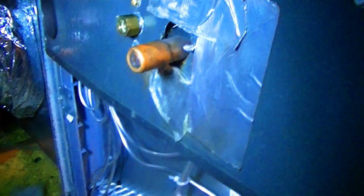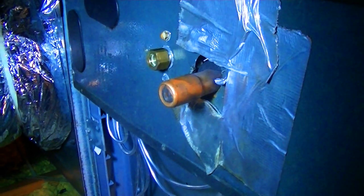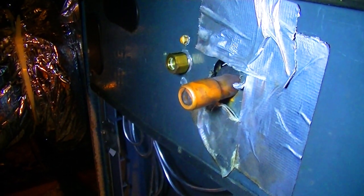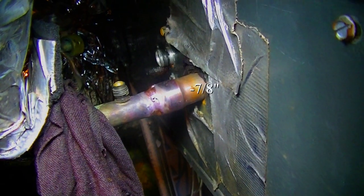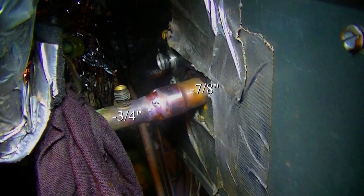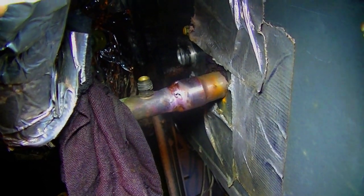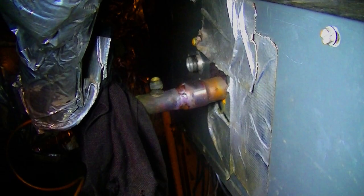On the back here, there is a Schrader port on that particular coil. If you are new to brazing or don't have a lot of experience brazing, go ahead and take that Schrader core out. As the years go by you'll have no problem brazing it up with the Schrader core in there. I do wrap a few rags on the inside so it should be well protected, but if you're new to it and feel like you might be dwelling on a single joint for a while, go ahead and take it out. There's our joint all finished up. As it turned out, the suction line from the coil was 7/8ths and my line was 3/4, so I took my 3/4 swage and put it into my line coming in here - swaged it out a little bit so it was a nice flush fit, same as having a reducing coupling but done on the spot without needing a coupling. I'm going to go put this flare connection back on and go down and turn on the nitrogen.